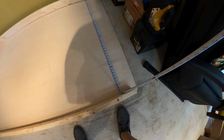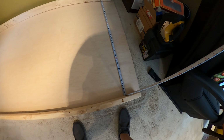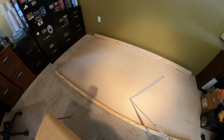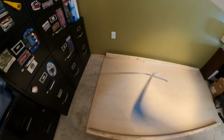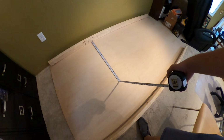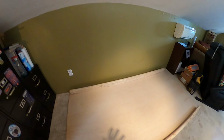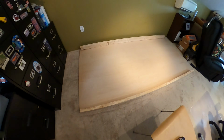I'm going to need to do it 45 inches because it takes into account the width of 2x4x8s. So if I cut them 45 inches, I can lay it down just like that and tack it in. So I'm going to need 1, I'm going to put one there, 2. I'm going to put one roughly on this side here, all the way at the end. That's 3. And then I'm going to put one right about here. I will space it out, obviously, appropriately. So 4 of those. So it will be a nice solid box, which when it's flipped, the plywood will lay on top of. I'll fix the plywood with screws, and then I put my legs on.